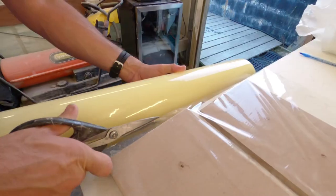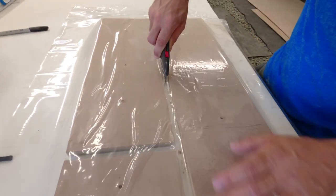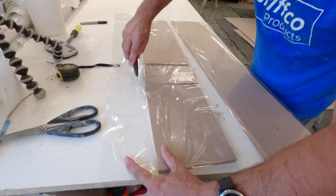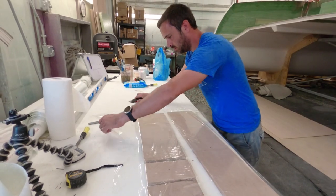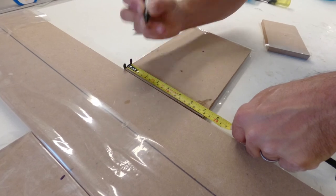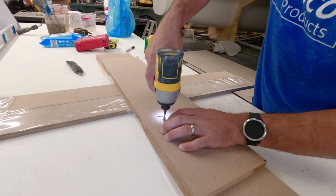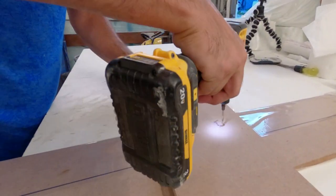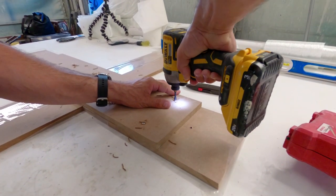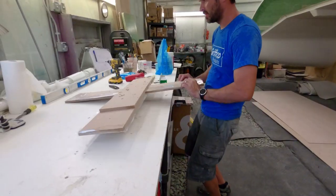Matt had made a few cuts with the board, which would eventually be put together in a cross shape to lay on top of the webbing. Adding clear plastic tape to the bottom, it would allow us to easily pop it off once all the resin on the fiberglass had cured. We knew that by having this mold in place as we bonded the newly cut 90 degree pieces to our foam core webbing, it would help the top portion of the fiberglass match up with the webbing so we could have a fully level surface once we go to put the floorboards down.